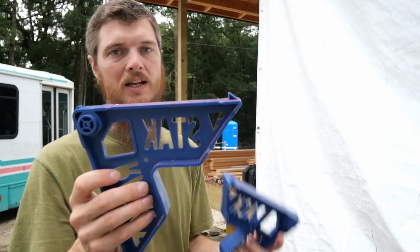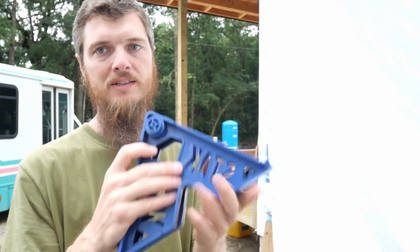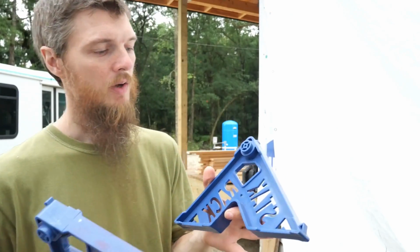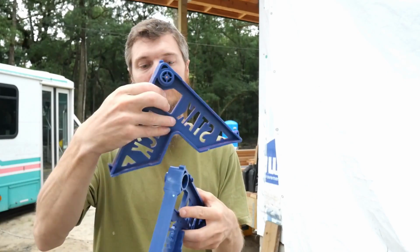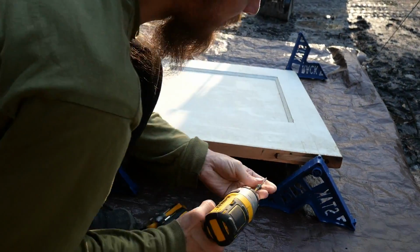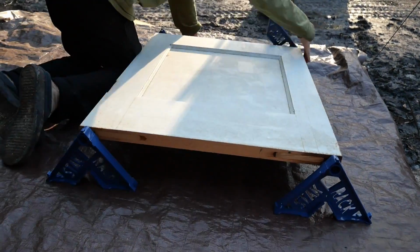Previously, we showed you guys these. These are stack racks. And I'll leave a link to them in the description. Now, stack racks are a pretty simple product, but very useful. And what they do is allow you to create racking systems, stackable racks, to dry painted materials. They're really ideal for painting doors. And what you do is you screw these into the ends of the doors, one at each corner, and the door is suspended off the floor and you can paint it.